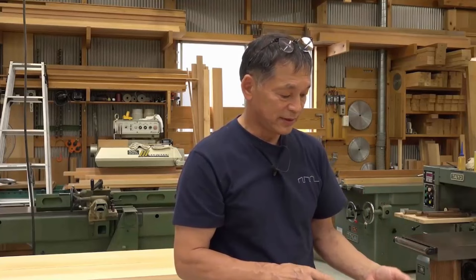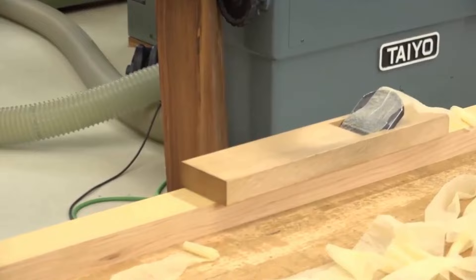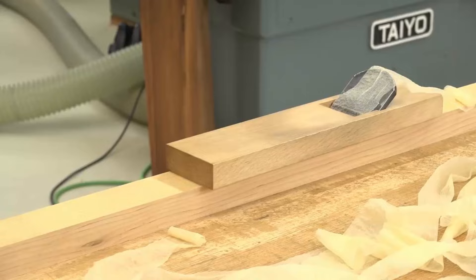My plane's body is about 3 or 4 millimeters shorter in depth than standard planes. This makes it easier to hear the sound of the wood being planed and feel changes in texture through my hand. The thicker it is, the harder it becomes to feel those changes through your palm. However, if it were even thinner, it would warp with age and become difficult to use. One cause of tear out is how fast you pull the plane; another is how well the blade is sharpened. Even with the same plane and blade protrusion, tear out may or may not occur, so I work through these issues by being mindful of the grain type and listening to the sound the blade makes.